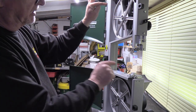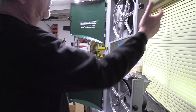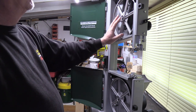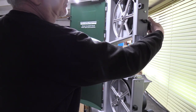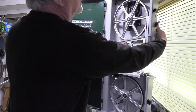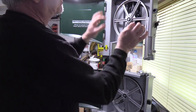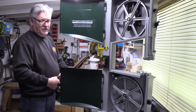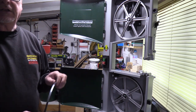The tracking is when you line the bandsaw blade so it's approximately in the centre of the band wheel, and we do that with the tracking lever which I'll show you in a second. Now we can come to putting the blade on. This lock here is for the tool arm — if you undo that you can move it down. Ideally you want to move the tool arm down to about the centre of the band wheel to help you get the blade on. Before you put the blade onto the machine, it's always worth checking if the teeth are in the right direction.